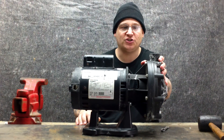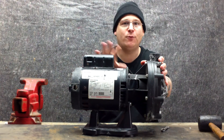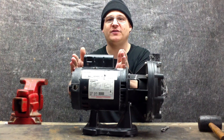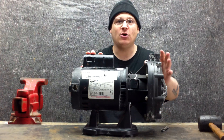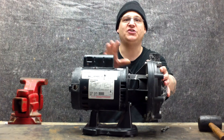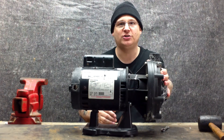The second thing is your wet end, which is this plastic part right here. On a pool, spa, booster pump, or pool cleaner pump, the plastic is usually your wet end, and the rear part is usually your motor end. We're going to be showing you how to take apart the motor and also how to rebuild the whole complete wet end, which includes the impeller, the seal, the seal housing, and the seal seat.